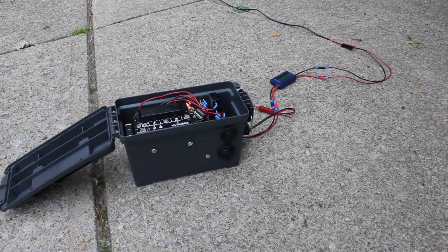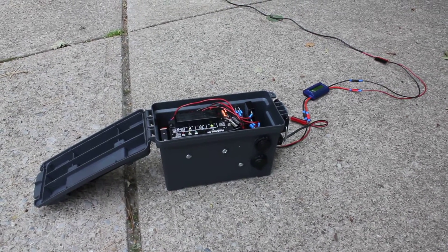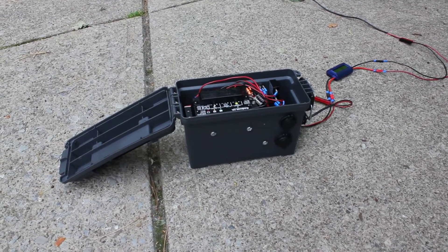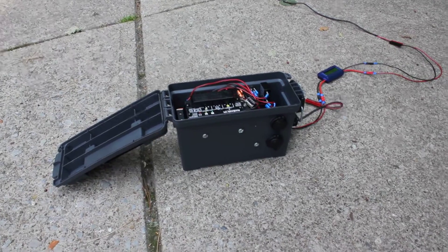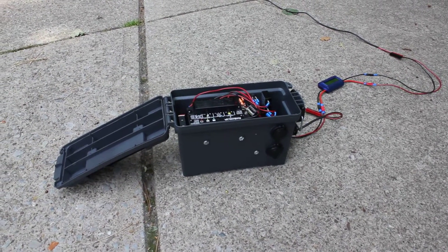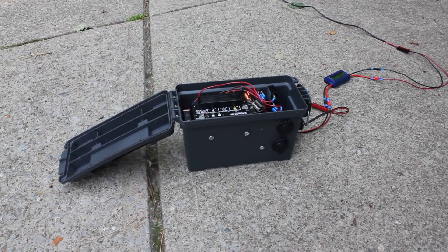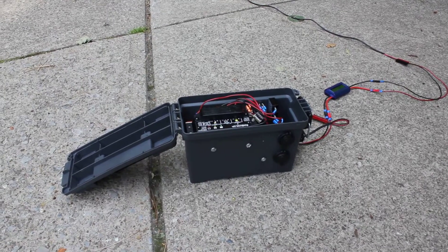Just wanted to make this a quick video as a follow-on to my other videos about this little project. Stay tuned — I'll work on a different setup, a little bit different configuration. I think you'll like it. I'm very happy with my initial results. It will look similar to this but the internal components will be different — the battery is much lighter and you can get even quicker charging results with the MPPT. This one only takes about under 2 hours in direct sunlight to get back to full charge on a 12 volt, 12 amp hour battery. Alright, thanks for watching — don't forget to subscribe, give me a thumbs up if you liked it, and if you have any questions feel free to put them in the comments below.